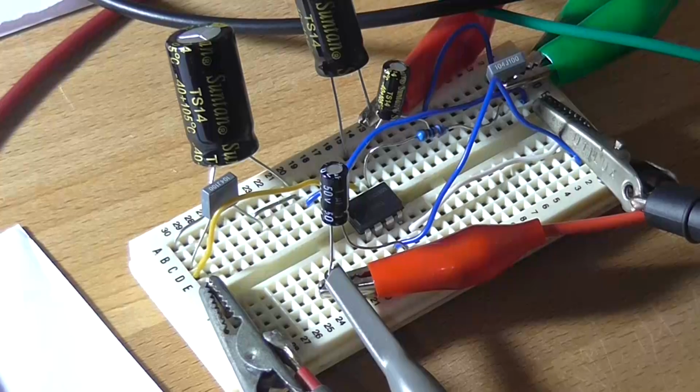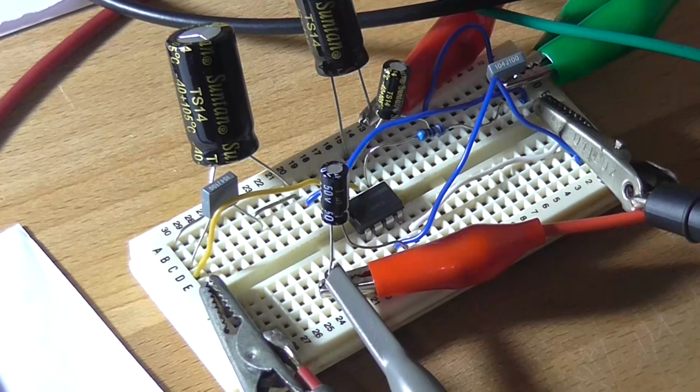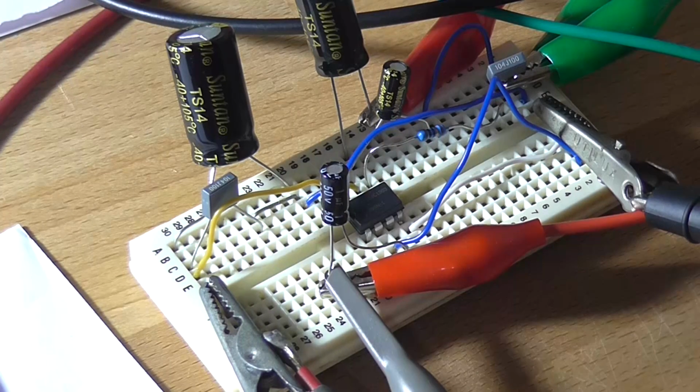So we know that this IC obviously has limitations, but it's still impressive for a 40-year-old IC that was made by Texas Instruments. I don't know who made it originally, but it's about as old as the LM741. So they're about roughly the same time. And as I said, this has an internal gain set of 20 to start, and it was designed from scratch for that purpose, to have a default gain of 20. Because this particular IC was designed to be put into TVs to power audio, sound and radios and stuff. That's why they made it.